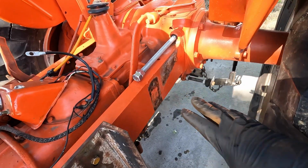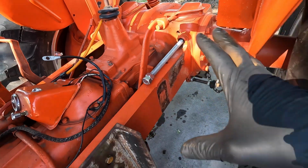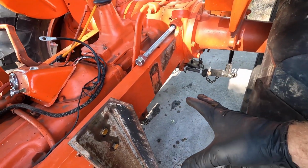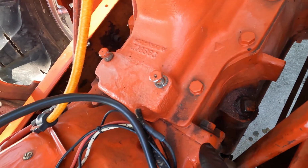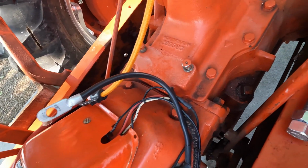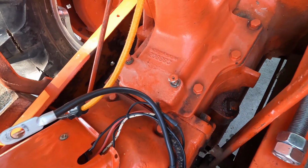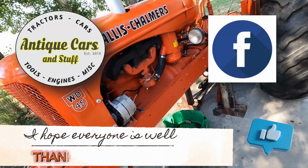I don't have a lot of wiggle room as far as height adjustment because of these rods, but hopefully these will keep everything pretty much in alignment. And with the floor jack, I think we'll be able to get this done. I think there are only 6 bolts that need to be removed now. There's 3 on this side and 3 on the other side, and then we can proceed to split the tractor and make the repair. So I hope you guys join me on the next video to see if we can actually pull this off.